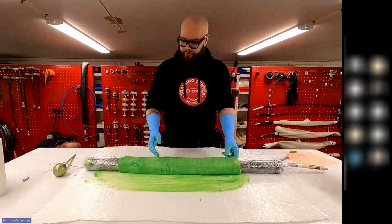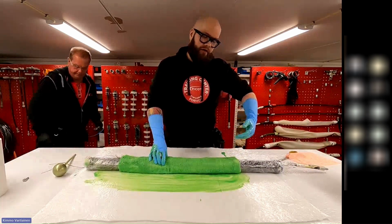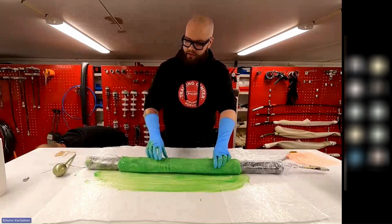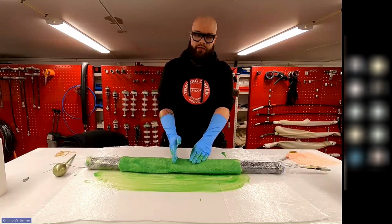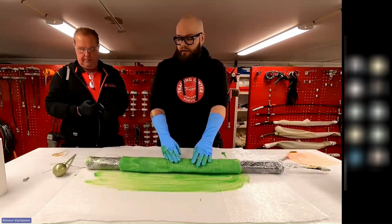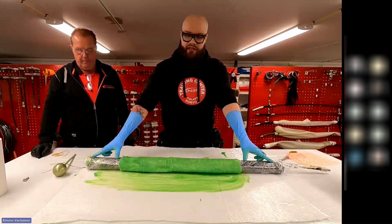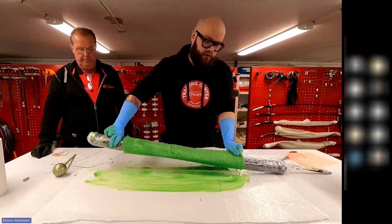So now I add the patch piece. The packer goes inside the liner, and I put the patch piece in the middle, and now we are using the Bendy packer. It's important to have it in the middle because that is where the inflation starts. Also, there is the safe space that needs to be on each end, and that is in the fact sheet or in the manual of the packer.